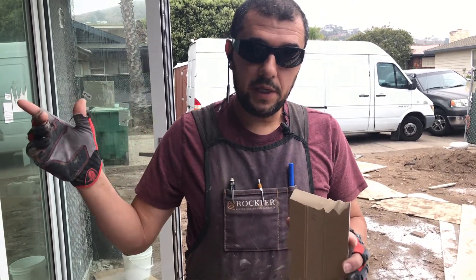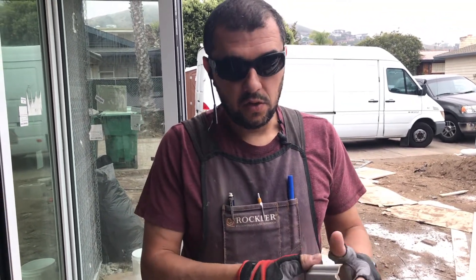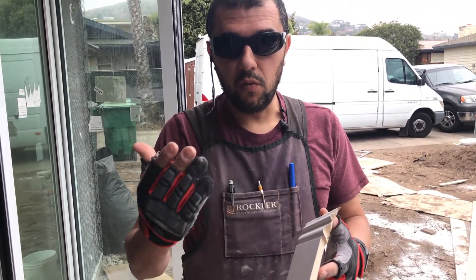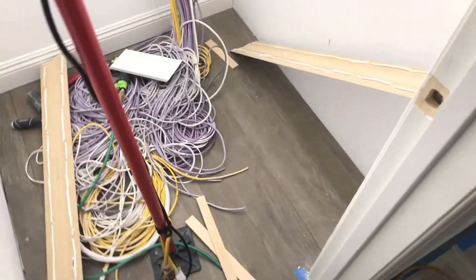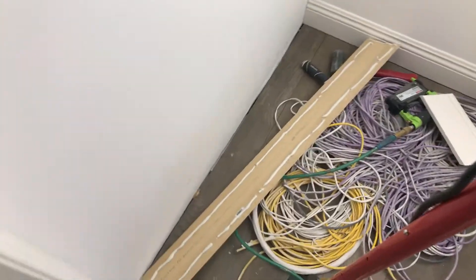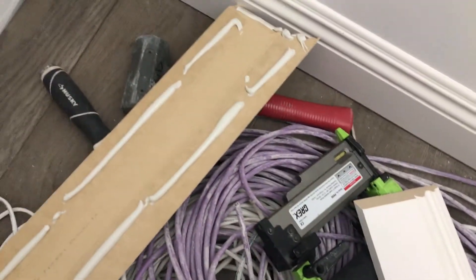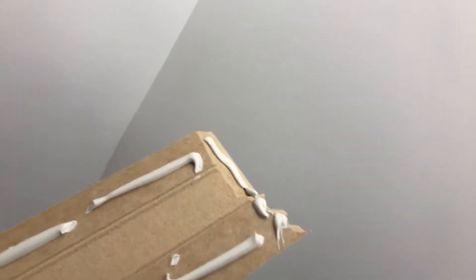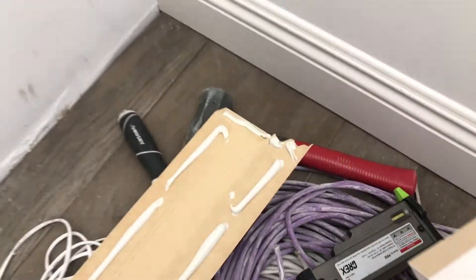Let me do the rest of the pieces, and after getting everything ready I'm going to show you how it looks inside. It's going to look really tight and it won't matter what the wall is doing. So we are ready to install the last two pieces — right-hand side with coping and left-hand side also with coping. Let me show you how I have this piece — it's ready, coping, instead of doing an interior miter. So it's basically miter versus coping.